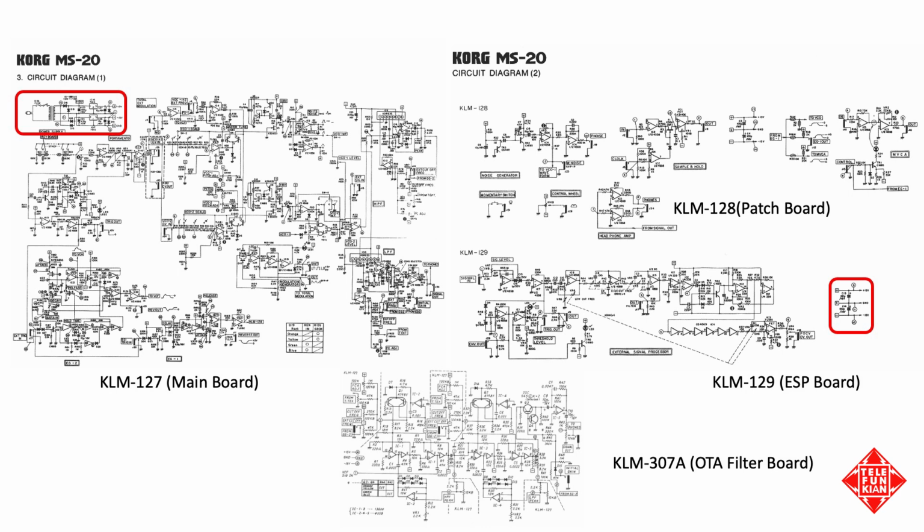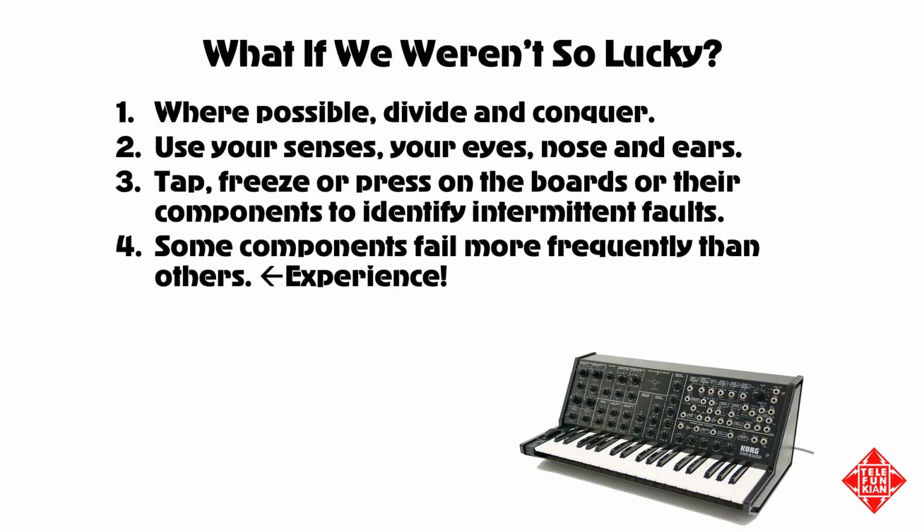And what you've seen is exactly what played out for me in real time. I've edited this video down for the sake of brevity, but I might have spent a total of an hour working on the diagnosis and the repair, and that included all of the filming and manhandling 3 cameras. The thing about working with vintage electronic instruments is oftentimes a low-tech approach will be adequate to facilitate a repair. The divide and conquer approach that we used, separating the individual PCBs, is a helpful place to start wherever possible, but oftentimes instruments aren't constructed in a manner that will facilitate this.